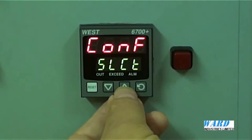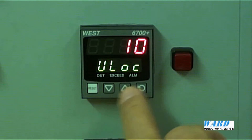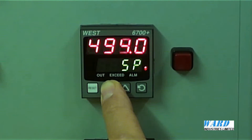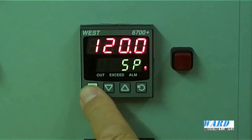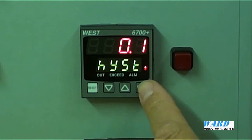Let's come out of here and go into the next menu, the setup menu. The default for this is 10. Set point — this is our critical alarm point, we want it as 120. Again, there's an adjustable hysteresis that we can put around the alarm point.